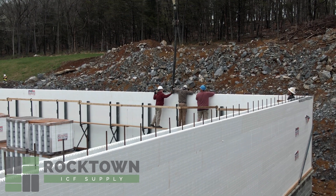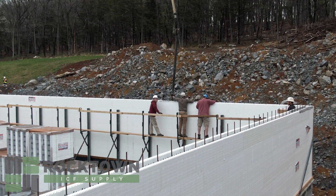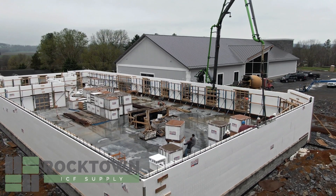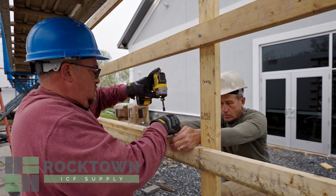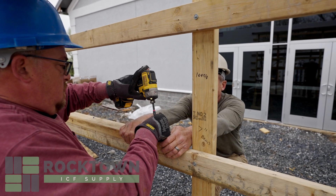While the concrete is fresh, you have an opportunity of maybe half an hour to manipulate the concrete and push it and brace it in. Within an hour or two, you're not going to be able to push it, so it's very important to have a crew waiting and watching for every potential flaw.